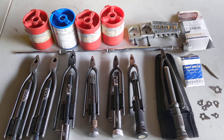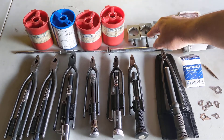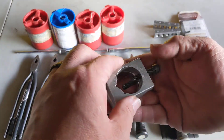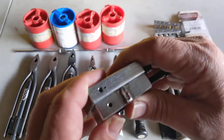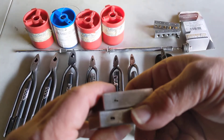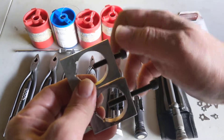Stainless 304 covers the majority of what you're going to do — low temperature to basically no temperature — intake manifold bolts, transmission, whatever. Back here we have a couple of setups to drill into your hex. We have two of them; they're fairly the same. This older one I actually broke trying to clamp it too tight. They come in two sizes: this larger one is for 3/32, and this smaller one is for 1/16. You put the corner of the bolt or nut in, clamp it down, and drill through.